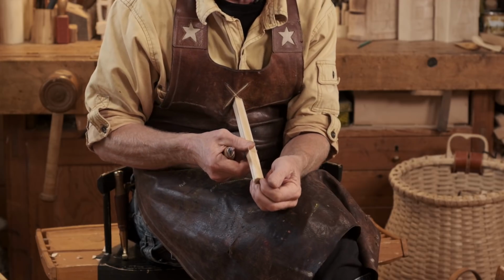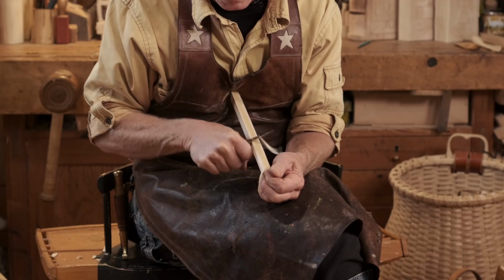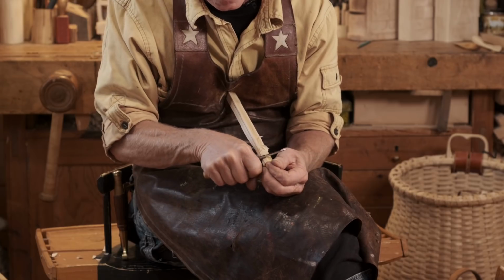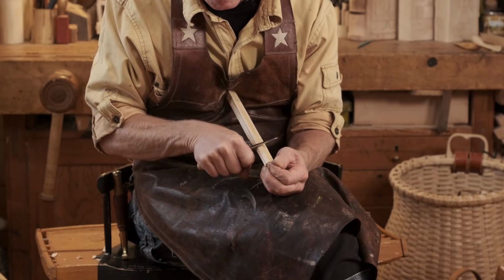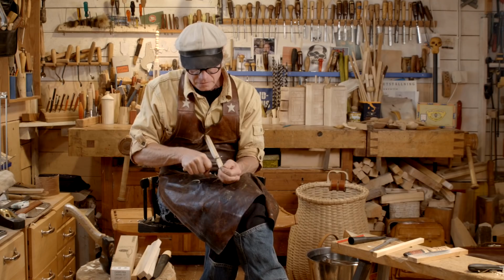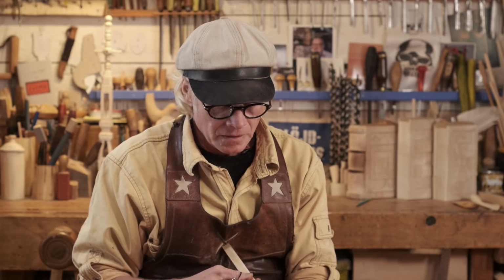And then I move this hand up here and use the pull grip like this instead, trying to see that line all the way up here and work myself up like this. So here you have to be very careful. As soon as you can feel that the knife starts to cut cross wood, you have to switch the knife's direction in the wood. So you can actually see that if you take a close look at the wood.